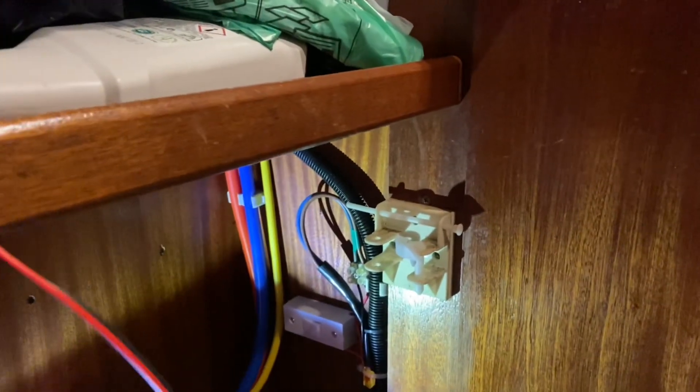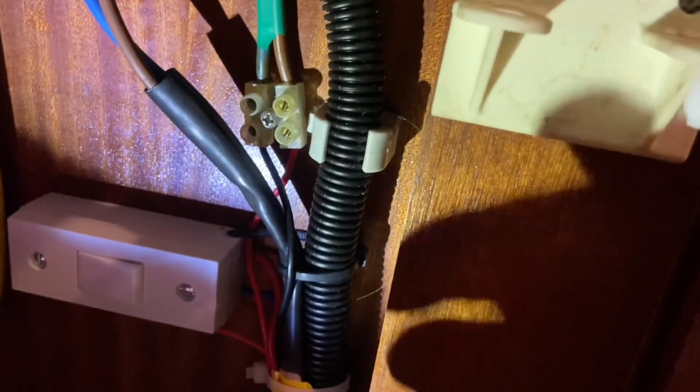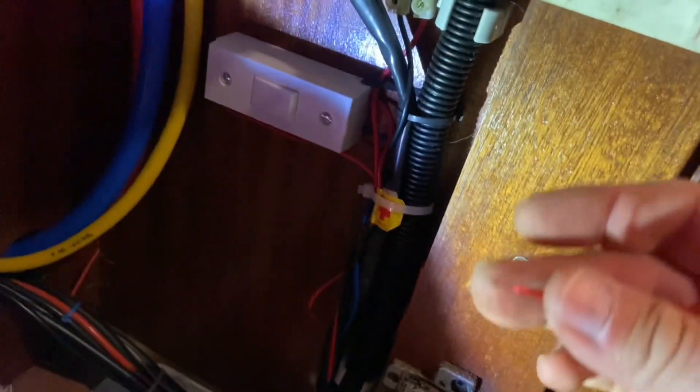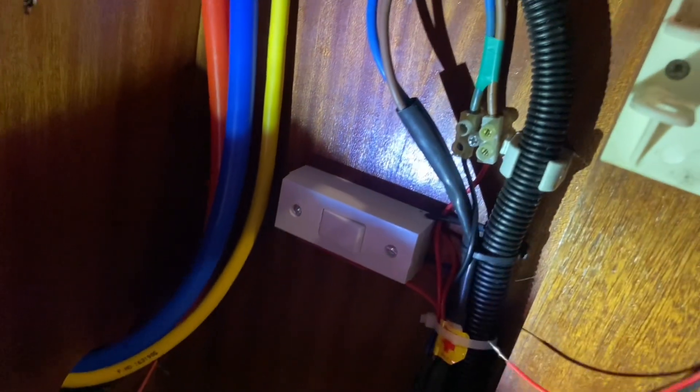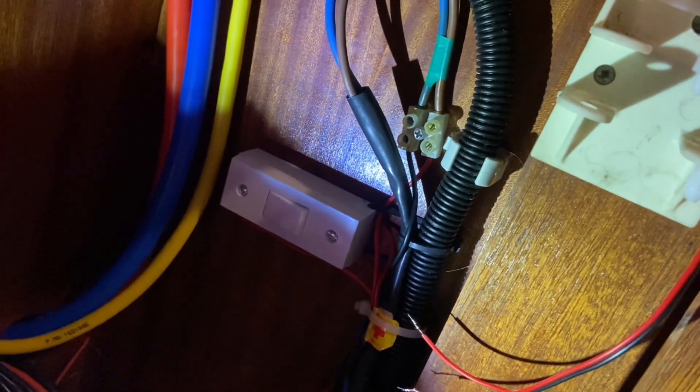For the 12-volt power supply, I've got my wires coming through under the sink, which I can run down easily. I'm going to tap into my bilge pump power supply — that's dead straightforward. I've stripped my power supply leads back, showing a bit of wire, and I'm going to tap them in there. Red positive, black negative, and this one is blue and brown — brown positive. Before I do that, I'm going to knock off the power supply, because I don't want to pull these leads out and risk them shorting if they touch.